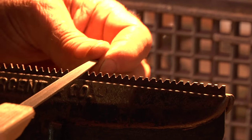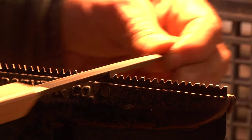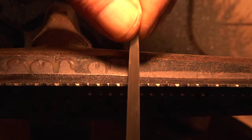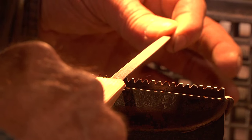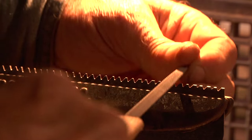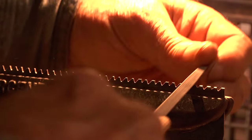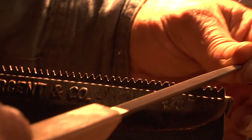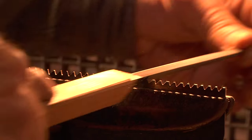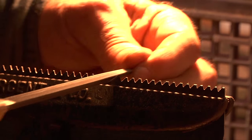I can influence the file — this is straight down, and this way I can push it a little bit towards forward. I'm not keeping track of how many strokes I've made on any tooth, and I haven't kept track of where I've been. I'm just getting a visual on it quickly and deciding immediately where I want to go and how many strokes I want to make. As I'm working the material off, I try to keep my file in the same direction and just keep switching teeth. Then as I get a little bit closer to the final outcome, I'll start switching back and forth quite a bit more.